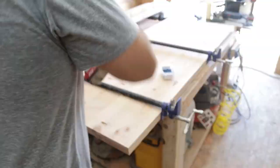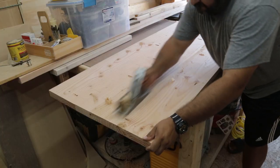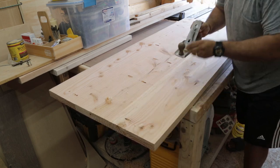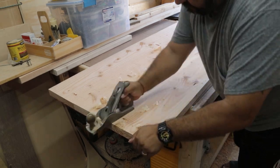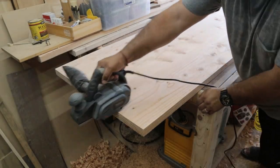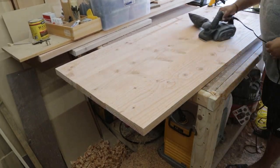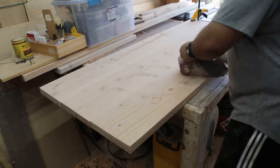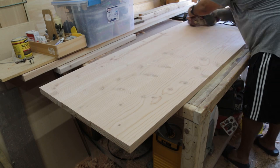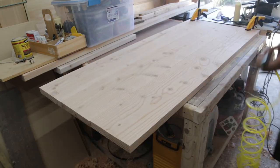This process is real quick and easy — a lot easier than just using glue and clamps — and you don't have to let it set up overnight. Because this is dimensional lumber, I did have to pull out the plane and really get out any uneven marks that the planer didn't take out or that were left over from the glue-up. I switched from my hand plane to my electric plane just to move things along a little faster. Next I switched over to my belt sander with an 80 grit belt and knocked down all the damage from the planer, getting a nice pretty slick surface.